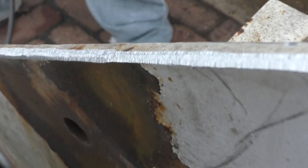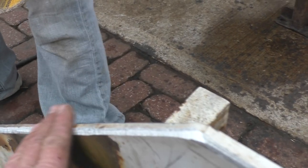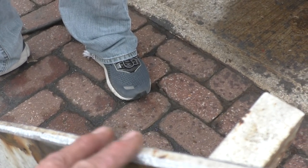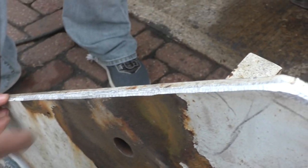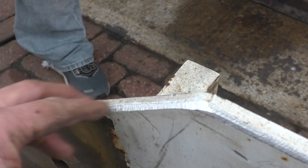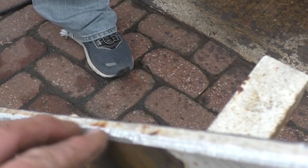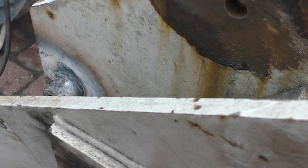And they're a whole lot easier to fall against. If you make the stroke all the way from top to bottom, it'll be a little smoother. Use a big grinder to do that much, and then get that flap disc thing, and you'll be able to smooth this out even better. Actually, we like it to have some tooth to it, because the paint just grabs onto that and holds on better. Because what you're doing is you're keeping the paint from chipping off a sharp corner. And you're also meaning that when somebody falls against it, they're less likely to open up a blood injury.